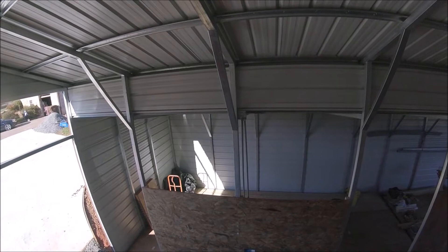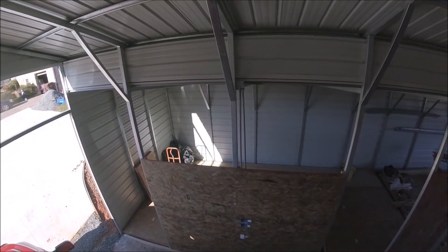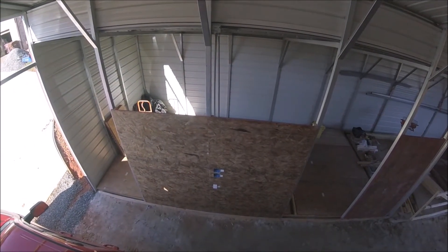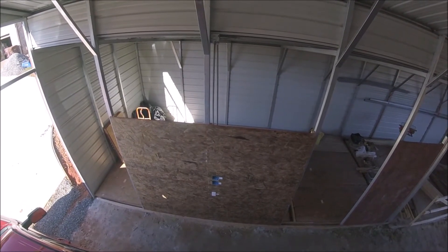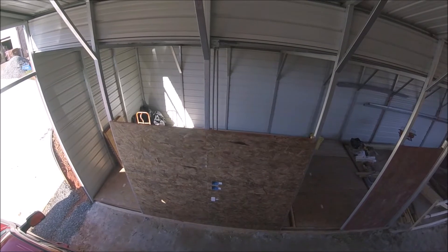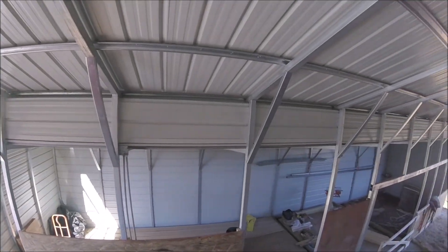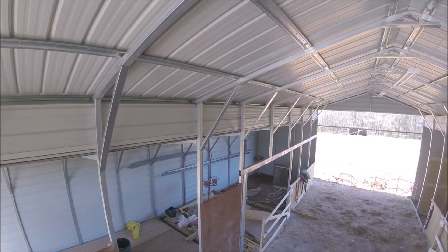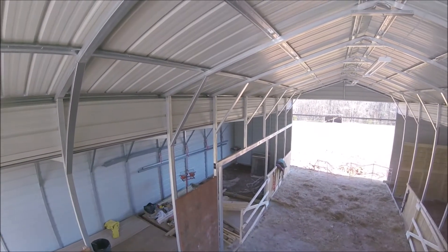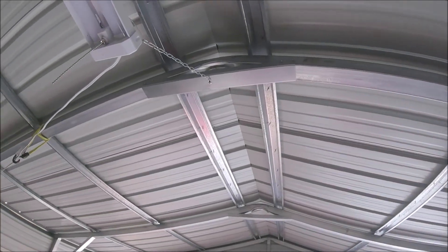Basically what we'll have is two circuits running down through there — one will be for 120-volt GFIs, one on this side of the wall and one on the other side. Then there'll be some switch banks — you can see the boxes I've got are meshed in. That'll be for each one of the stall doors, as well as the wash bay and the outdoor exterior floodlights. I've already got one box on and all those hard-piped with wire tubing all the way down to that wall. I don't like heights and I wanted to get this hardwired in, at least started.